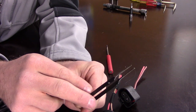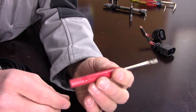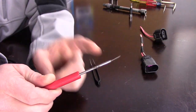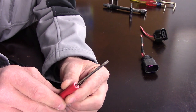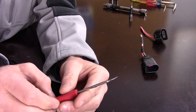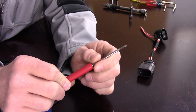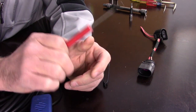Back to screwdrivers — in the electrical world there's this screwdriver that I ground down. It's just a plain old pocket screwdriver whose pocket clip broke off, so I decided to customize it. This one was great for something very similar to releasing connector tabs. I custom-made it when the Mark 6 Jetta came out — there was a recall very early on where I did several lot cars to replace wiring for the fuse panel and relay panel. I ground it down real small so I could fit it perfectly, rotate it, and release a tab to help me do a job much faster.